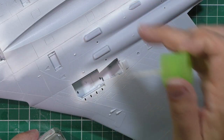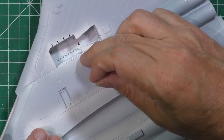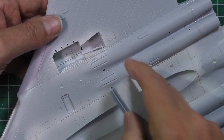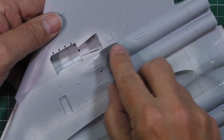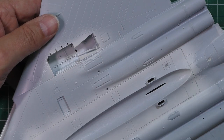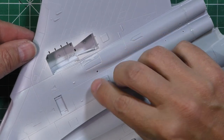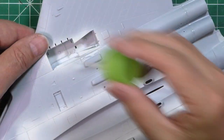Once it's got a little bit of a light hold, just add a little bit more glue, then give a quick tap to make sure they're all seated nicely. That's those in. Then we can do the same on the other side. I've got a little bit of a fingerprint mark down in there from where the glue hasn't been great, so we'll just come up with a sander and sand that out because we won't be able to get in there particularly well afterwards.